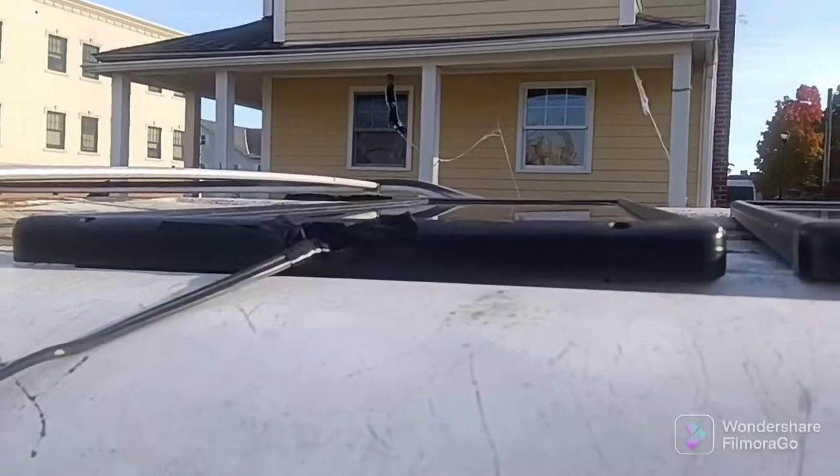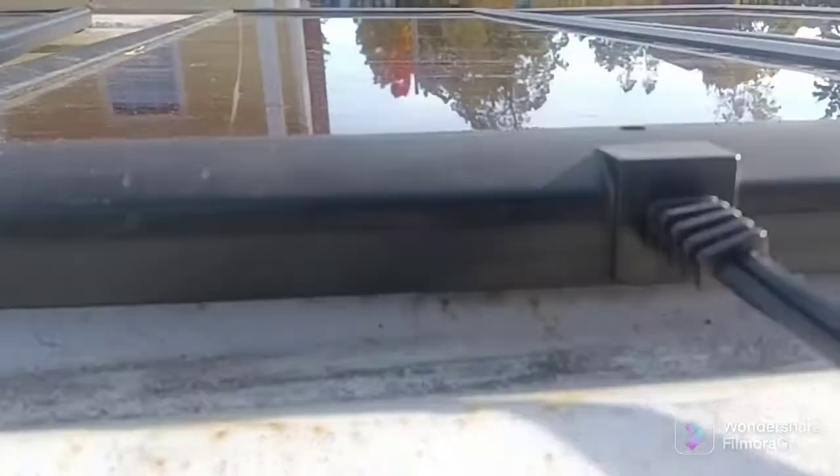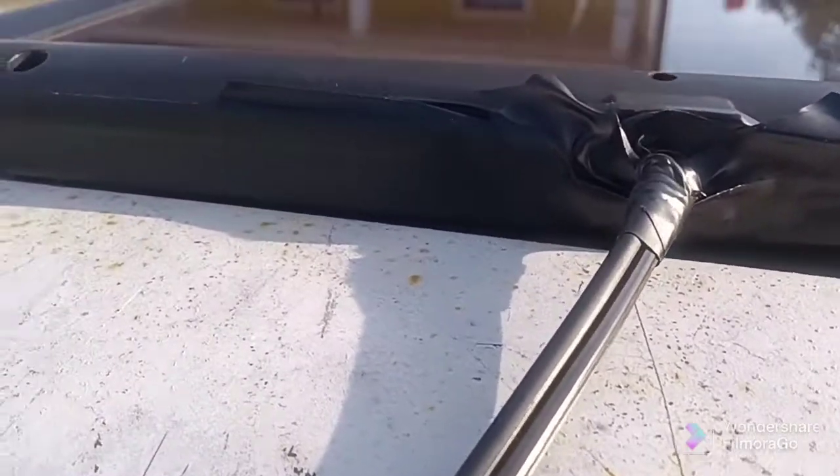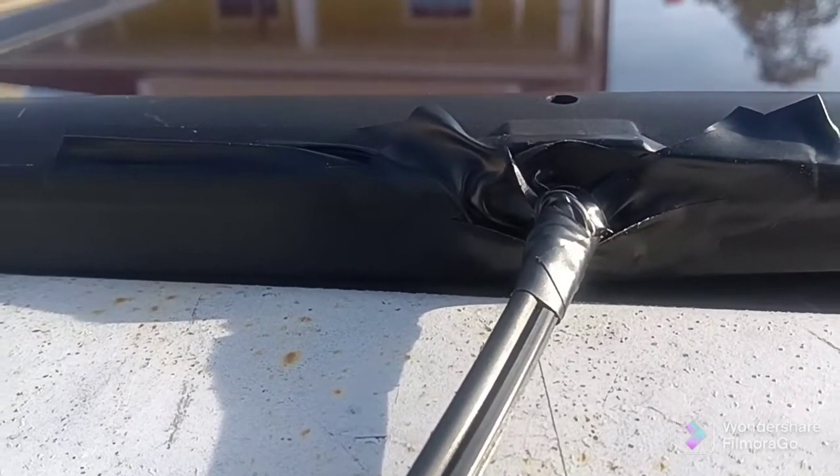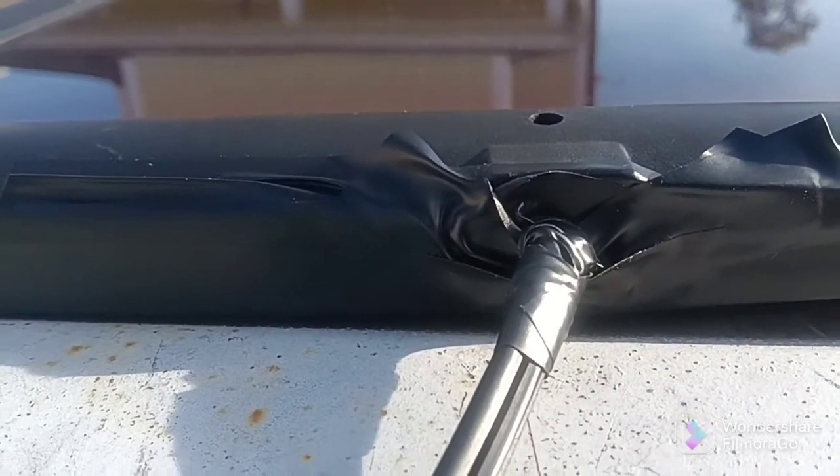I'm going to switch you around and let you check it out. We've got the solar panels up here, and this connector broke and one of the connections was off — I was wondering why, on such a beautiful day, I wasn't getting enough solar. Ended up having to splice it together, tape it, and fix it up. That's working just fine now, though still a little low on solar, so I'm going to check the connections on the batteries too.